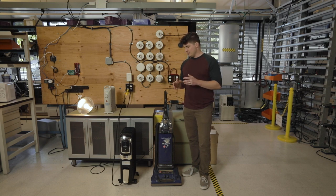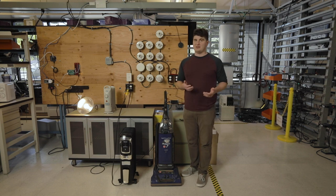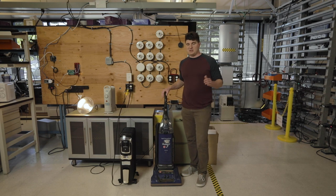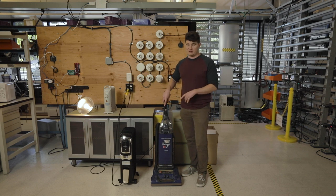What we'll do now is show what happens as it gets later in the day and you have less power available. Because brownout control, it's a very capable technology, but there's gonna be a limitation to it. At a certain point in day, there's gonna be just not enough sun hitting your panels to power the loads that you have. So we're gonna simulate that now by dropping the irradiance level to 300 watts per meter squared, which is sort of like mid-afternoon time, the sun's setting, you don't quite have enough power available, you still have enough power to run lighting and probably one space heater, but not enough to handle the inrush on this vacuum cleaner.